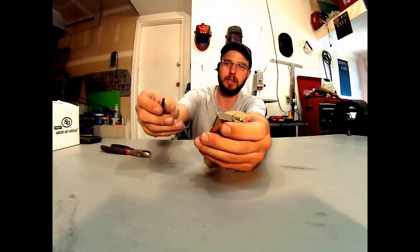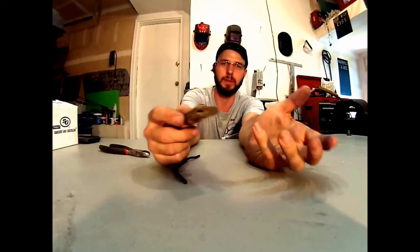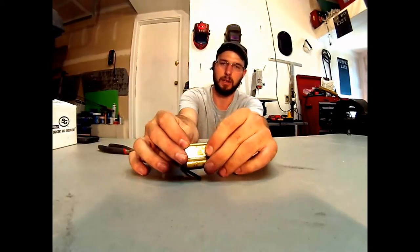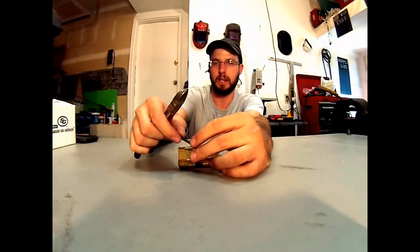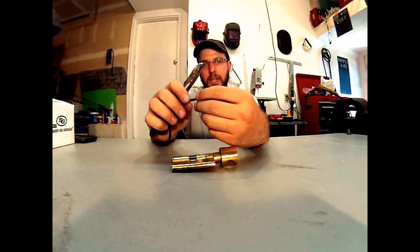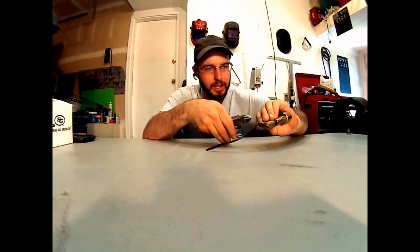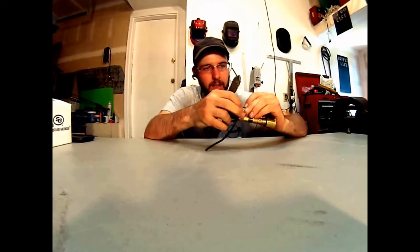But for these, I have developed a little tip and trick. Once you get the plastic out and say that it gets ruined or broken or whatever, you would then be able to dump all the pins out and the springs, and then insert your key and start rebuilding this, adding the pins in association with the numbers on the key. I found this screen — the thicker screen material — basically what you would put in to hold screen into like a window frame.